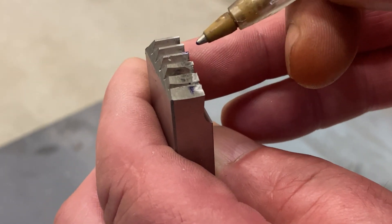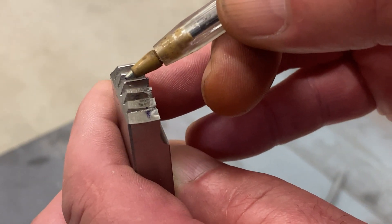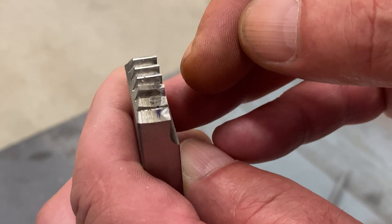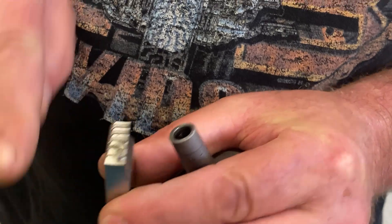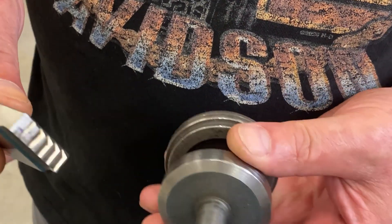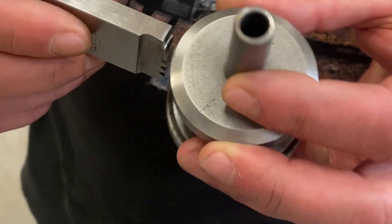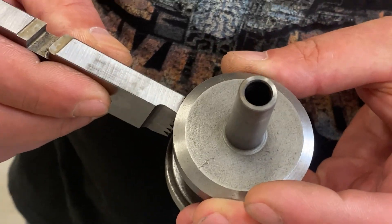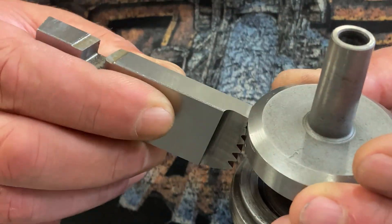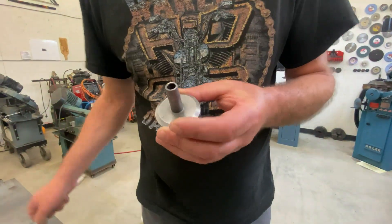Basically what I need to make sure of is that my radius touches the back of the teeth slightly before it gets to the front of the teeth, and that'll be how I know I'm maintaining a clearance angle on there. My first step is to determine exactly what radius this is so I can put that same radius on a grinding wheel. I don't have radius gauges this big, so I've just been grabbing random things and seeing how they fit. The radius on this tool is a little bigger than what I'm holding here, so I'm just going to keep trying different things until I find the correct radius.